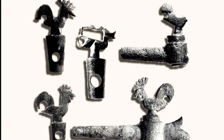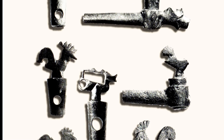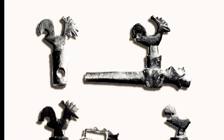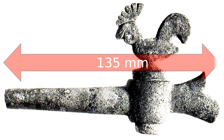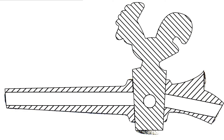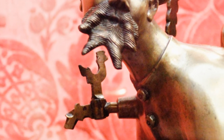The tap in question is from the early 1400s and was found in Zürich, Switzerland. It belongs to a group of taps which possess handles in the shape of stylized cocks. These taps were common from the 14th to the 15th century. It measures 135 mm by 76 mm, and its conical stopcock has a bore of 8 mm, as well as the bore through the length of the tap's body. I had made a couple of taps for 14th century aquamanils previously, so the topic wasn't entirely new to me.